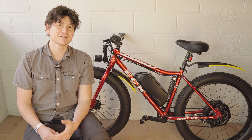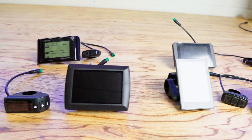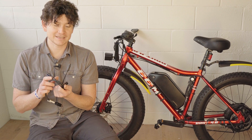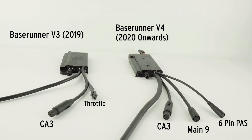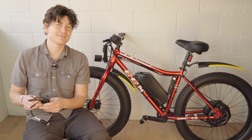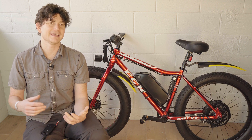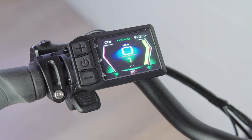A little bit of backstory: it's been known for quite a while that the ASI motor controllers have great support for third-party e-bike displays, ranging from very small OLED screens to big color displays that go right on the handlebar. Around 2019-2020 we decided to support those by including an extra connector on our Phaserunner and Baserunner motor controllers. In addition to having a Cycle Analyst plug, we added a new nine-pin connector that brought out the 5V transmit RX/TX from the display communication, which should in theory have allowed us to support other display choices and give customers the option of a detailed analytics Cycle Analyst conversion or a more mainstream setup with five levels of assist showing power and battery charge levels.